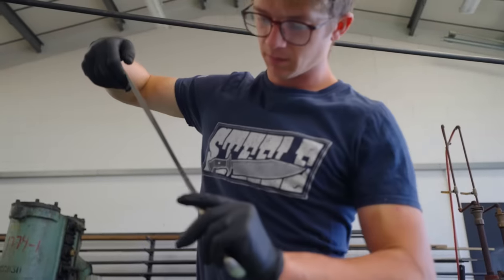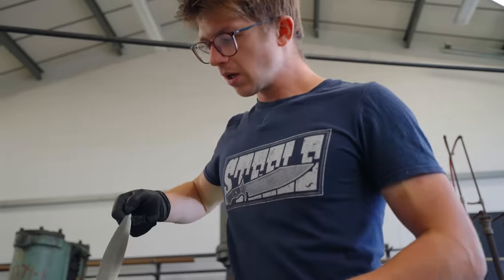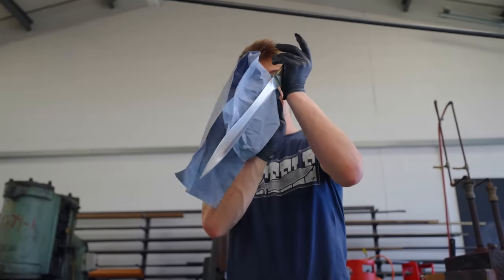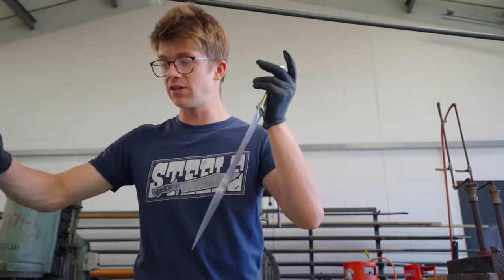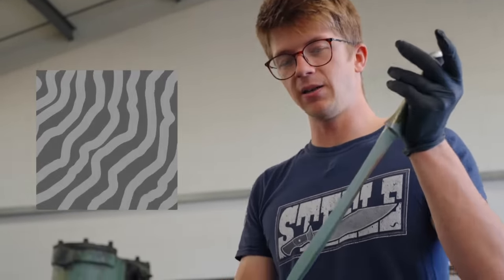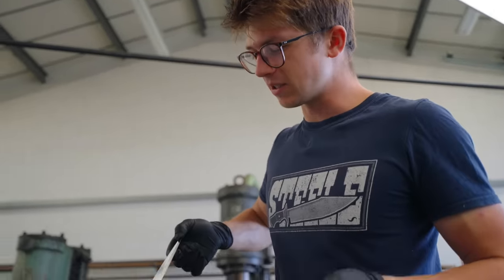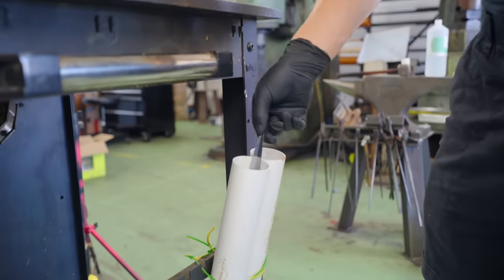So what is this going to do for the layman? Well, what the acid is hopefully going to do is etch the different alloys in the blade in different ways. Remember at the beginning of the series, we have 1080 and 15N20. The 15N20 has a higher nickel content, which makes it a little bit more corrosion resistant. The acid doesn't etch it. The acid will eat away the 1080 plain carbon steel, which gives us highs and lows and also darkens the plain carbon steel as it's etched away. So it just looks like normal steel right now, but this will reveal the pattern — hopefully.